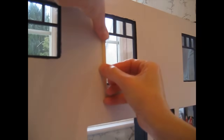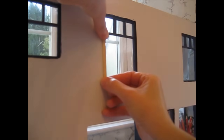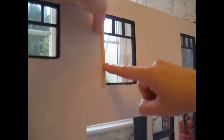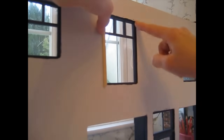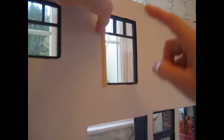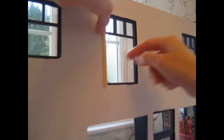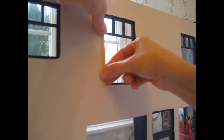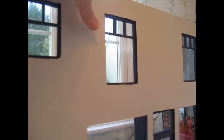And there's my first piece. And then I'll do the same at the other side of the window. Rather than just cutting another one the same size as this, always measure each side, because chances are there will be a slight difference. I know in each of these windows there is, from when I fitted that internal frame. That's a nice fit there, so I'll now do the other side.